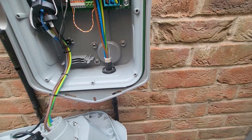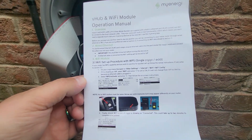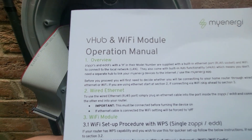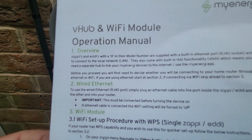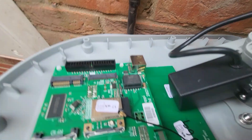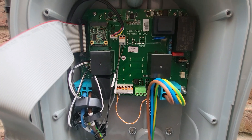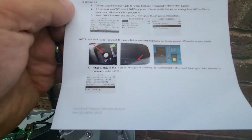Just a point of note with the instructions - they are now coming with this little leaflet that talks you through setting up the Wi-Fi. The rest of the manual is the same as the older version but this extra leaflet covers connecting it to the internet and replacing the hub. It says if you're ordering a Zappi and it has the H in the model number, that means it has the built-in ethernet port and Wi-Fi. If you plug an ethernet cable in it will default to ethernet, so make sure if you're wanting to use Wi-Fi you haven't plugged a lead in. If you have a router with a WPS button you can simply press that and it'll go through the process.